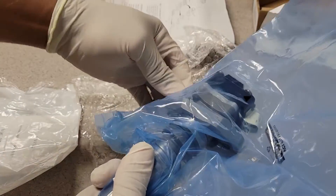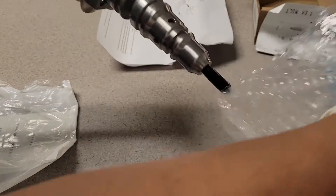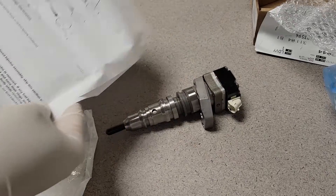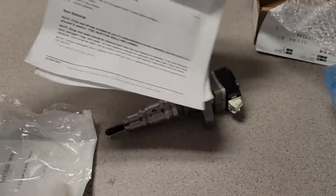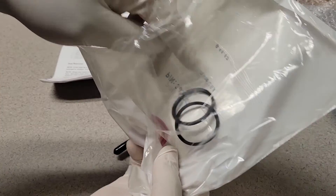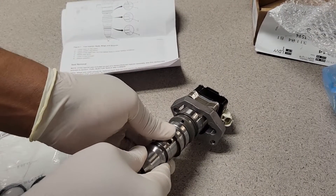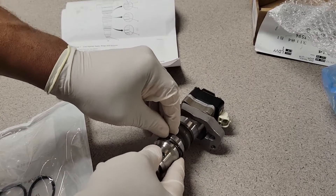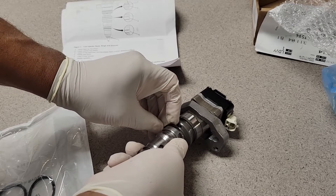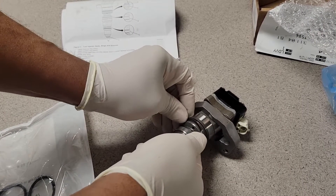You're going to put the old one back in the bag — they pretty much give you everything you need. The first item, starting at the top, is the upper backup ring, which is steel. This is the only steel piece in the kit, so that makes it pretty easy to identify. Just going to put this on first and walk it up with your finger. If you have snap ring pliers you can use those, but it's not necessary — just walk it on up carefully so you don't break it.